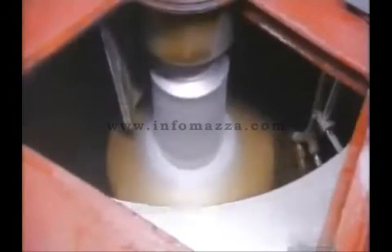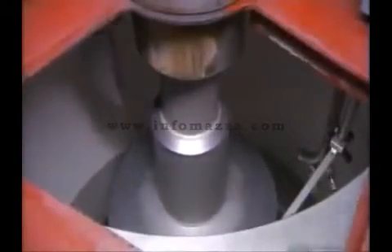It then goes into a high-speed centrifugal machine to remove the sugar crystals from the uncrystallized syrup. Inside, the sugar spins at 1,200 revolutions per minute. This action draws the molasses to the outer shell of the machine while the crystals remain in the inner basket. Sprays of water wash the crystals, then the water is drawn out so that only the crystals remain. This centrifuge works much the same way as a washing machine set on the spin cycle, drawing out moisture from the sugar.